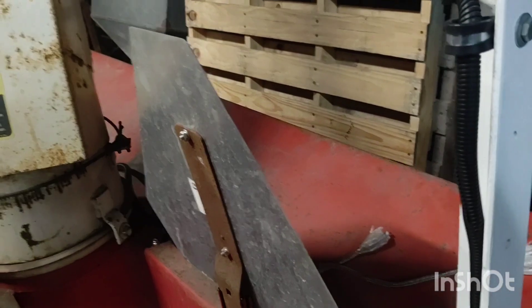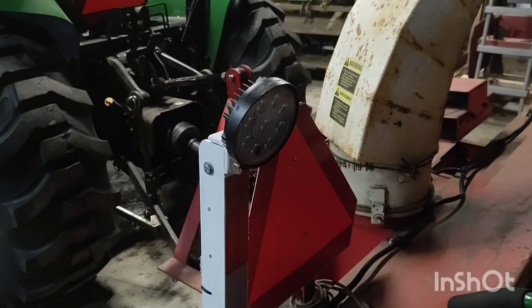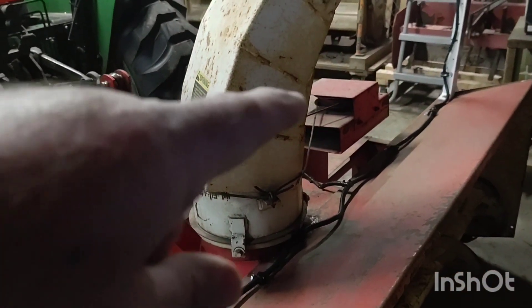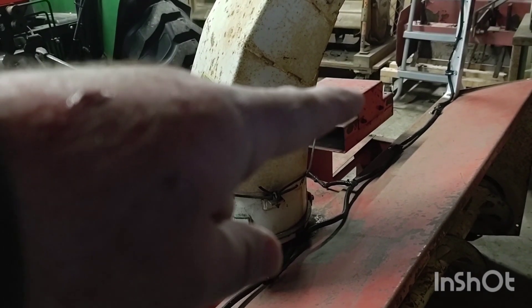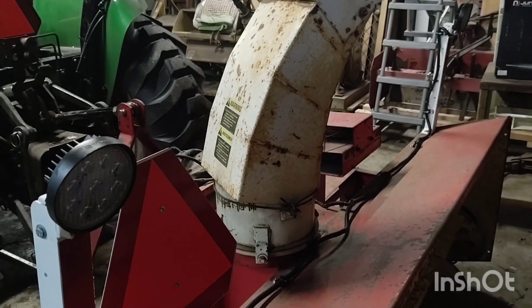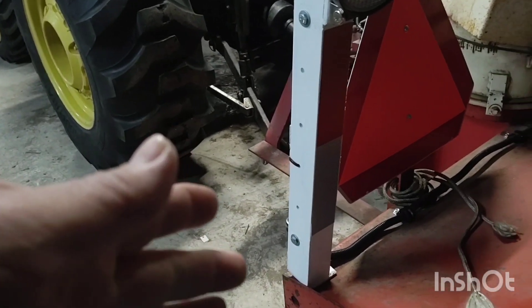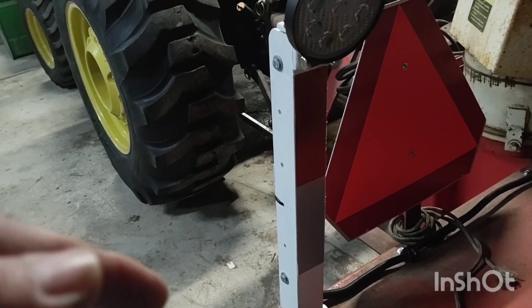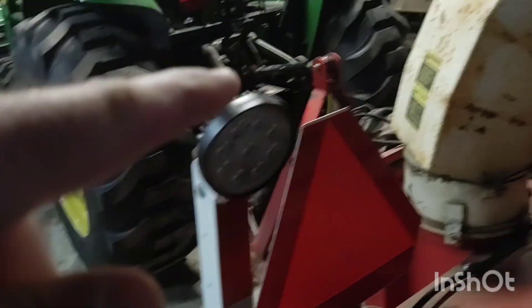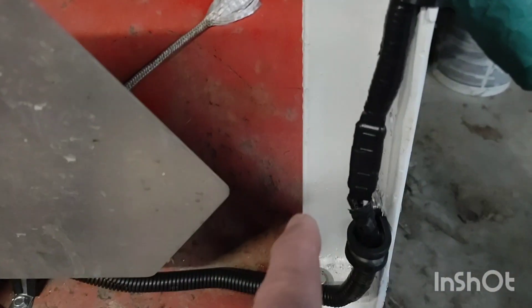One other thing I've done already project-wise is I relocated lights. Before, they were mounted over there on that little shield, kind of centered and pointing whichever direction. I had some angle iron so I fixed it to mount onto the blower. Put some DOT roadside reflective tape on it and now I've got LED lights on both sides up high. Hopefully it'll help me see where I'm going as I'm backing into the snow. Got them all wired up with a quick disconnect soldered onto the wiring.